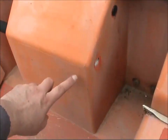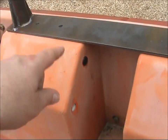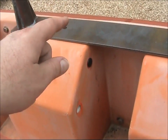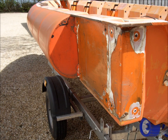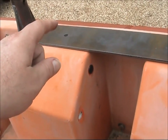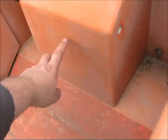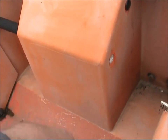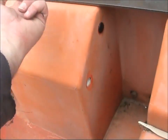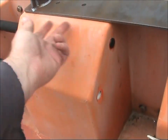So what I'm going to do, there's no other way to get into these boxes, into these panels. I thought you could get to them by taking the foam filled tubes off, but you can't. I took the foam filled tubes off, and it's blanked. So the only way is to cut into here. So I'm going to cut into here with a big round hole saw, and then once I have, put the nuts on the backs of the bolts, and probably put a plate on as well, a supporting plate under there,